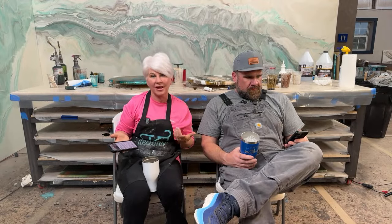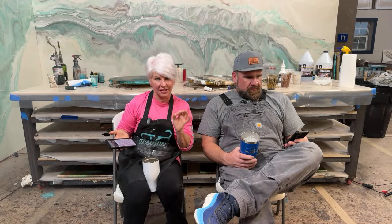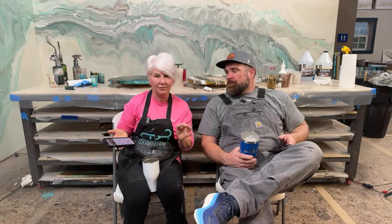Now, here's a fun fact. Normally, we've not been able to tint the undercoat successfully. You can't tint it with a paint, because a paint is a latex product and you're mixing it into the undercoat, which is not a latex product. But Mitch actually tinted it with our Color Art dyes, and they're actually not a dye. It's more potent, more of a pigment. I'll be making some phone calls to find out exactly what that is. But it was successful, so he was able to tint the white undercoat with some of that Color Art. I first tinted it hickory, which I thought was brown, and it was green. So then I just slammed in some black, and it turned it gray. That's some cool stuff.